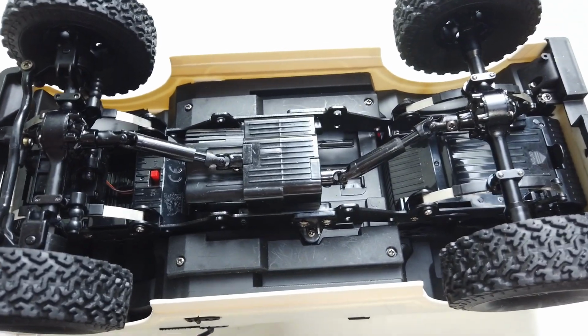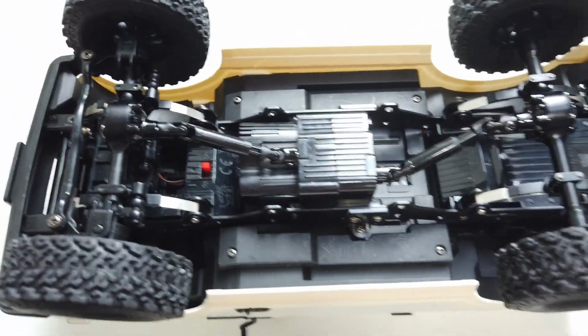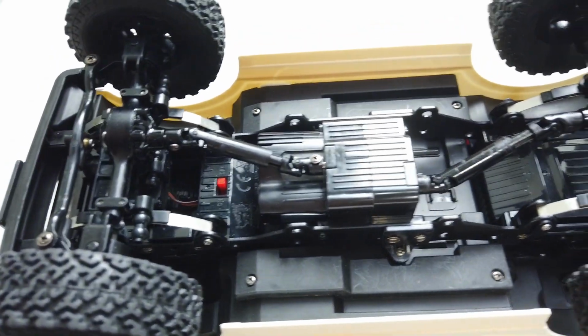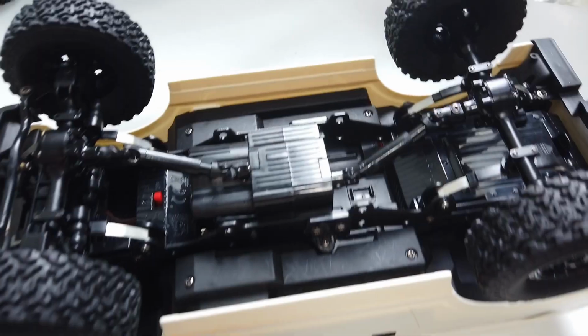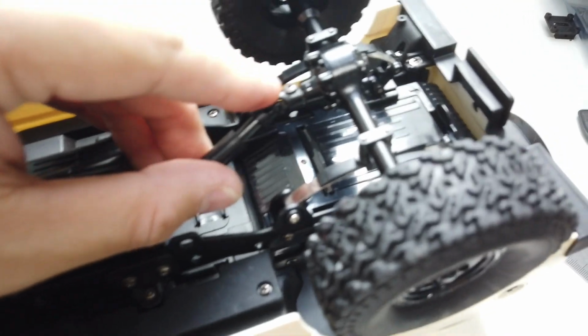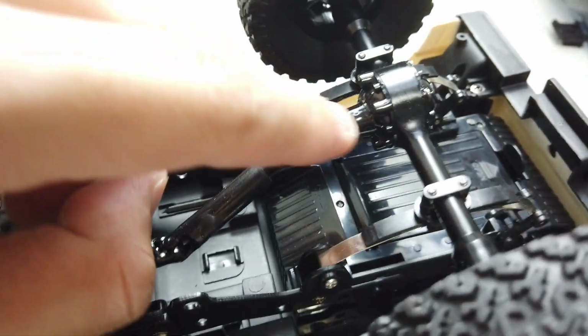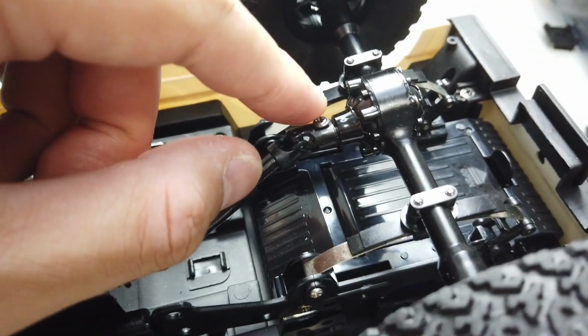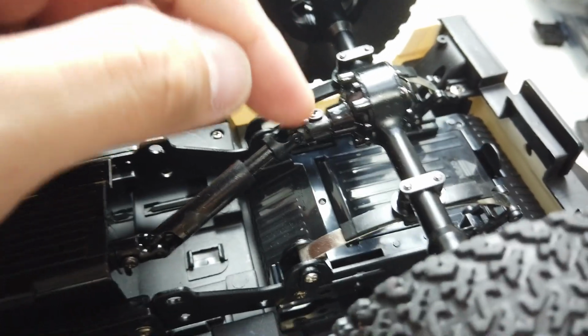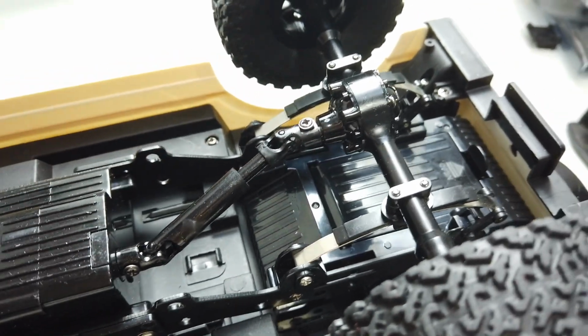And there are people who are facing a jarring issue with the axle or the drive shaft that was due to the out-of-phase drive shaft. It's already been identified and they are making changes to it. So if you have that issue, this one is thanks to Liam Sullivan. One of the reasons that caused this is this screw here being over-tightened. You may try to loosen it a bit because it goes in parallel to the input shaft, but once you apply the screw onto it, it sort of goes out of parallel, if you get what I mean. Like the screw is pushing this cup here out of center. So you can try that.